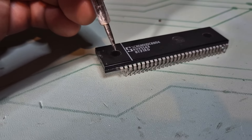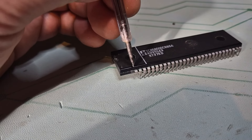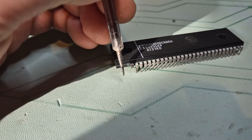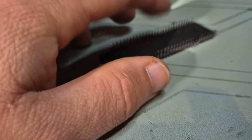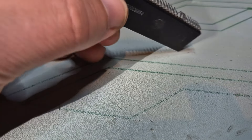Is there anything broken here? I need to take them out of the socket. There might be little legs broken. This one doesn't seem to have any broken legs — oh, I spoke too fast. I need to take those ICs out and see how many more legs are missing. We're missing three here that I can see.